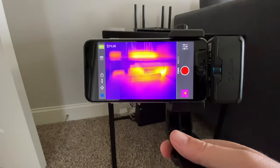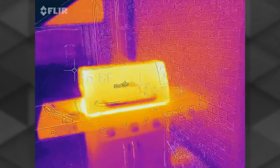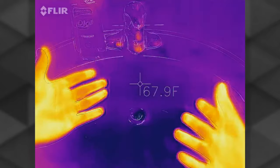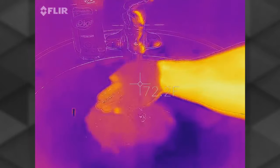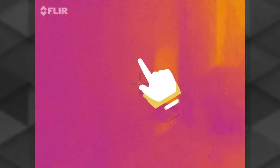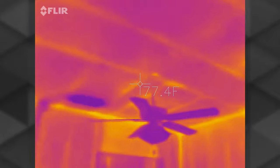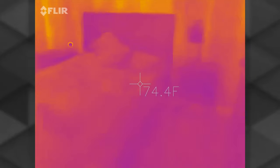The ideas with this thing are almost limitless. I've researched how thermal and infrared cameras work — here's my simplified explanation. This FLIR One Pro has two cameras built in: one thermal camera and one standard visual camera. This allows you to see both the details like text and image outlines, plus the thermal image layered on top. Can we see through walls? The camera shows temperature differences on the surface of objects, so generally no. But if you're looking at an exterior-facing wall on a hot summer day, the studs and ceiling trusses have a much greater temperature difference than the insulated cavities — thus you can see those otherwise invisible objects through the wall.